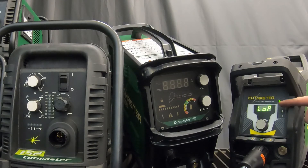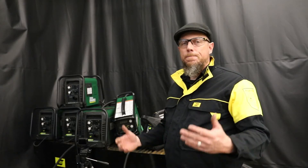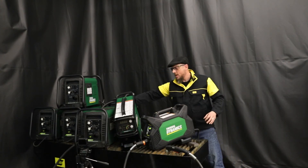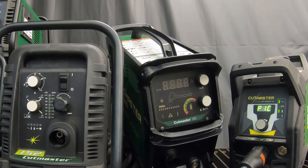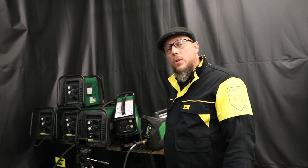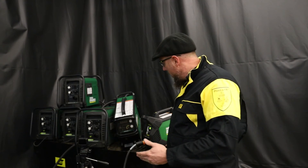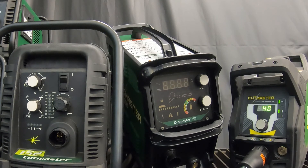From the front of the machine I can see I've got 40 — and L.O.P.: low pressure. Forgot the air again! Let's move to the back of the machine and push the air from the 60i X into the back of the 40. Now "Parts In Contact" — it started back over in that series again. When it tried to check the air, yes, the parts are still in contact. The first time it went through the series after I got my air connected, that reset the programming and it could try again. You heard it spit air, all lights green — we're ready to go.